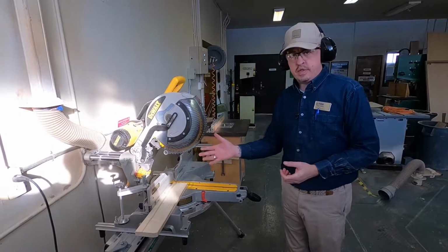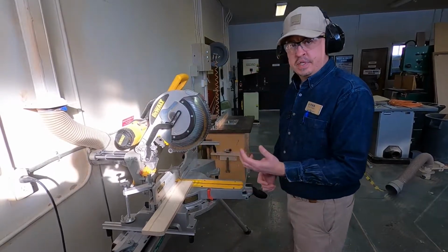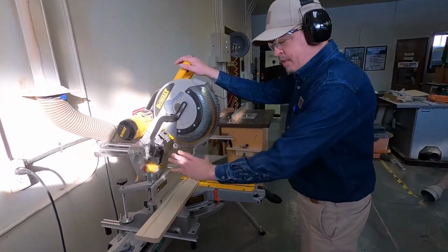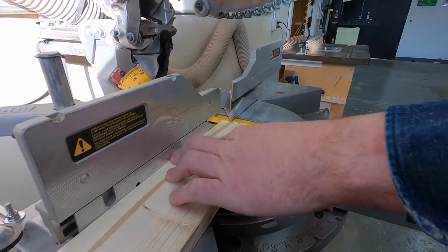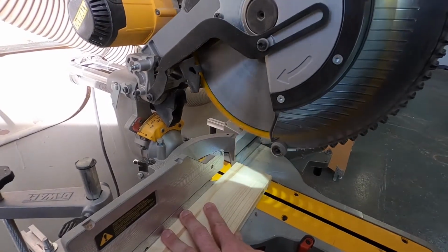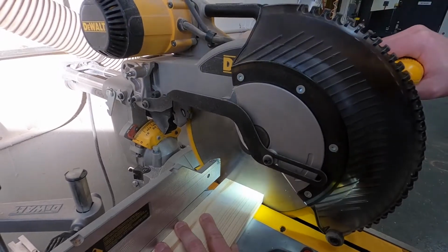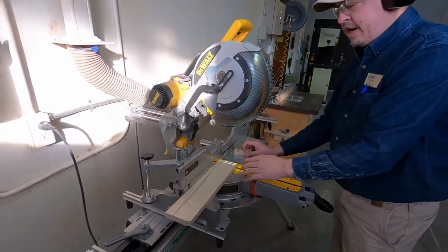Obviously, with the safety with this machine, you'll want to keep your hand away from the blade. So proper hand positioning is using your dominant hand on the machine and then putting your non-dominant hand pushing down as well as into the fence here. And once you've got that set, hand down and in, you're ready to do your cut. There we go, nice square, straight, and safe cut.